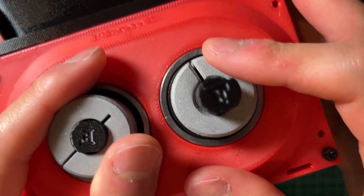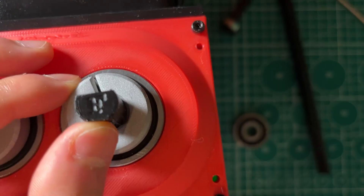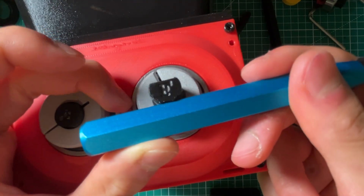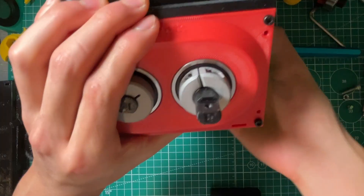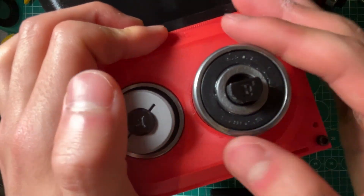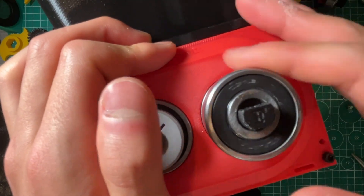On the second iteration, which I've already installed — and don't mind the shaft collars, we'll get to them in a minute — you can see the bottom of the shaft is flat. Here's a flat tool that lines up really well with it, and the top of the shaft is also flat. Look at how easy it is to slide the bearing on now, and you can see the outside rotates freely while the inside stays stationary with just the right amount of friction.